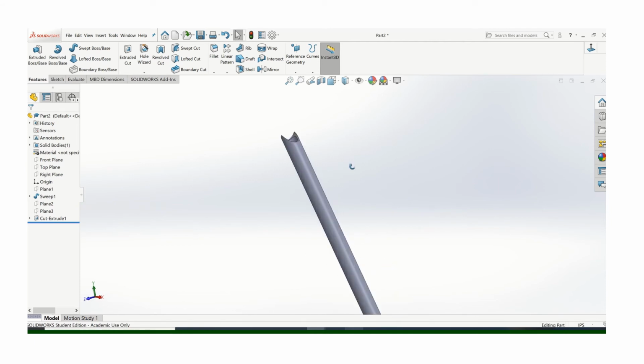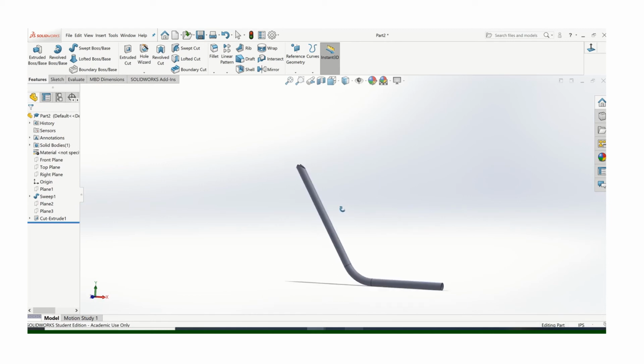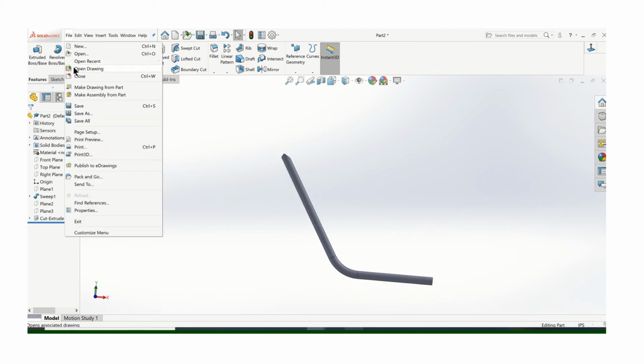So see how that's notched? When I butt that up against a piece of horizontal tubing, it should fit right into that notch. So there's my next piece of tubing. Now, something I didn't show you on the other one, let's save this thing. What I did initially is I created a folder on my desktop to save all these details in. So when you build an assembly, all of the details, all the components will be in the same folder.